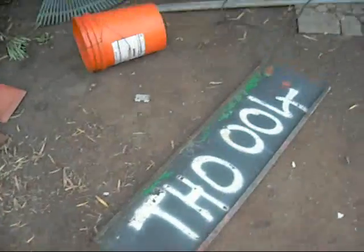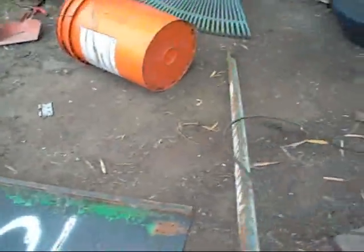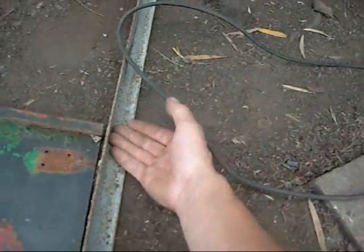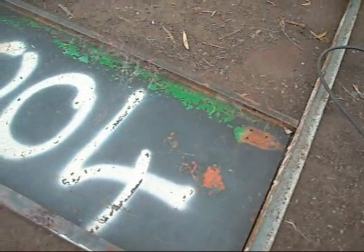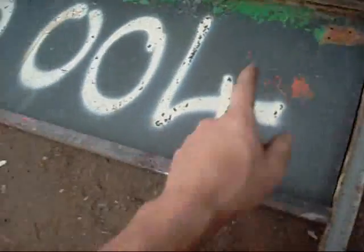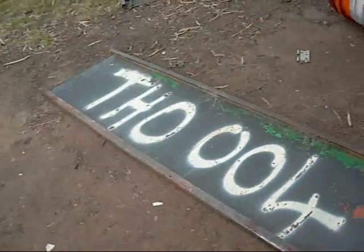The one I found at the yard is longer than I needed, which is good — cut that bit off. I'm going to cut some of this angle iron up and weld it on like so, so when you swing the latch in it hooks onto here. It's going to have one-way hinges so you can actually push the tailgate sideways when it's down horizontal and actually remove it, because you've got to be able to get an engine crane up to this trailer, and with the tailgate permanently attached it just makes things difficult. So that's all going to be done.